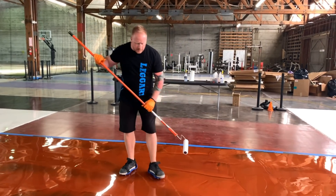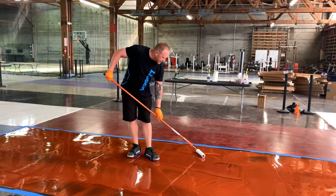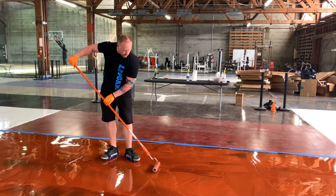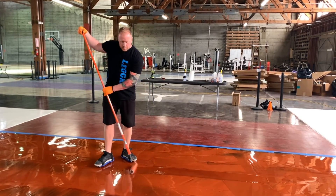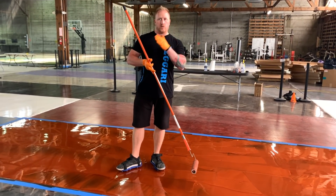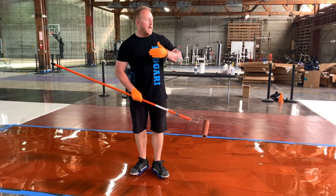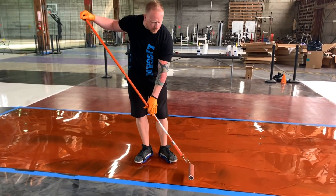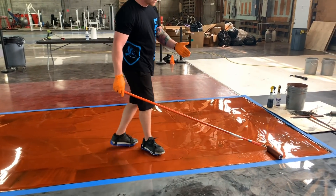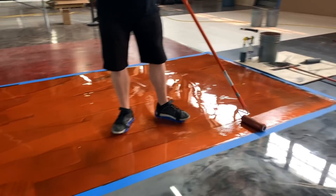The first thing we want to do is saturate our roller. I want to find some of these thicker spots in the floor and just saturate the whole roller. Then what I want to do is roll it out this way and this way — so I'm going to cross-roll it. This roller is going to pick up epoxy from thicker spots and lay it in the thinner spots. I'm going to start about in the middle of the floor, go one way, and I'm not pushing down at all on the roller — the roller's weight is doing everything. I'm going to make sure the edges hit a little bit, bring it back, and go this way.